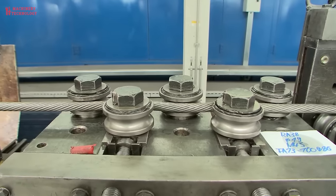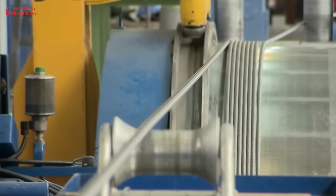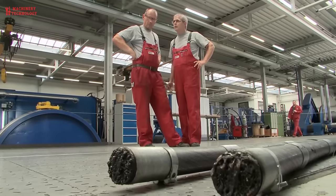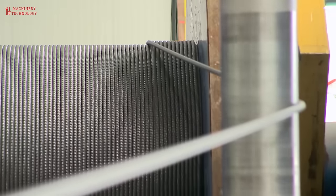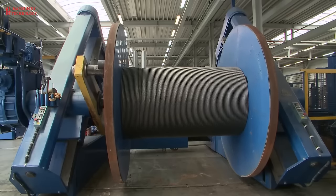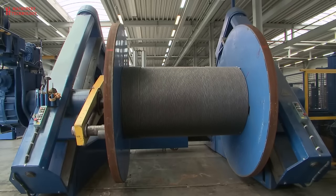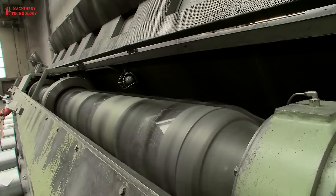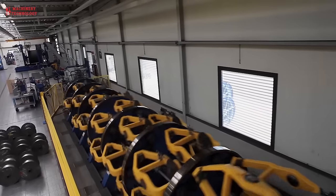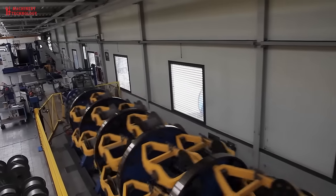Rope filaments, the first component. The filaments are cold-drawn rods of metal materials of varying, but relatively small diameter. The second component, the strands, can individually consist of as few as two or as many as several dozen filaments. The last component, the core, is the central element around which strands are wrapped. Wire rope cores maintain a considerable amount of flexibility, while increasing strength by at least 7.5% over the strength of fiber core wire ropes.